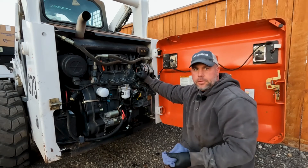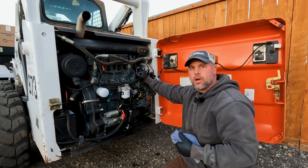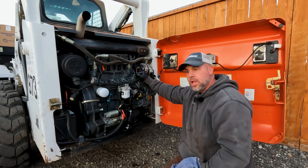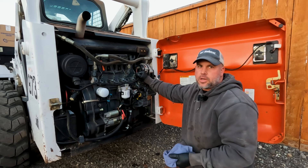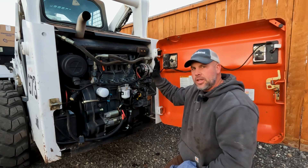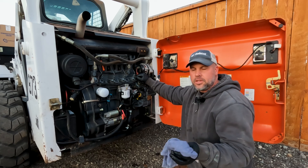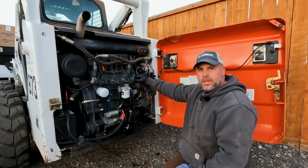So if you're ever changing the fuel filter on your Deutz engine and you notice that the fuel is black, hopefully this gives you an alternative source of what may have caused that. In this case it's just a little bit of engine oil and it does not hurt the engine at all. This Deutz engine will almost run on straight engine oil, so it's not going to hurt the fuel system at all. Just run the machine and you'll eventually run all that fuel out or dilute it and you'll never even notice it happened. Quick, easy fix — quick tip. Thanks for watching.